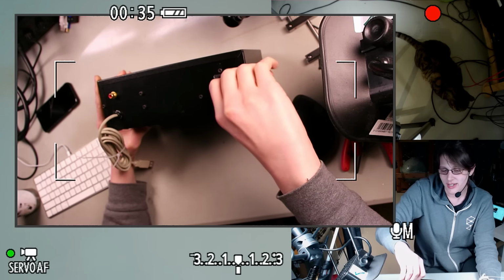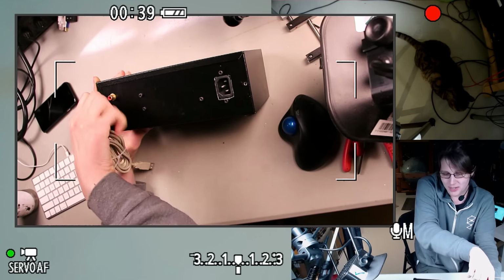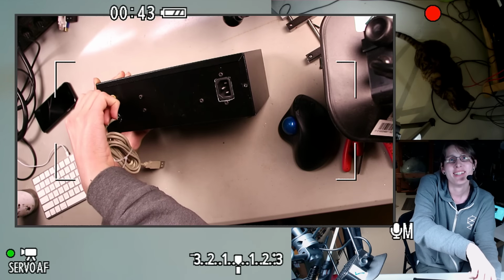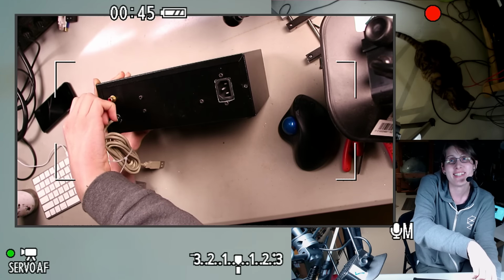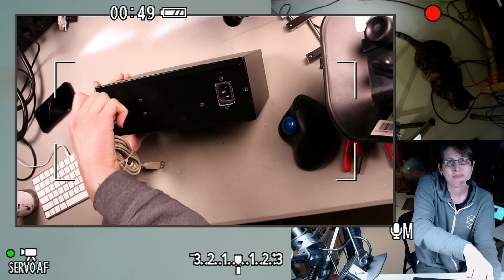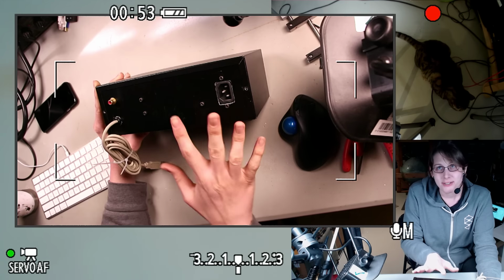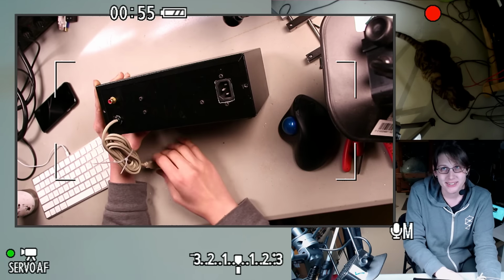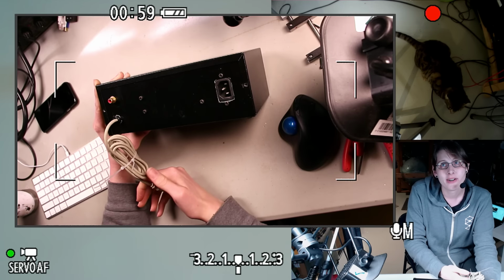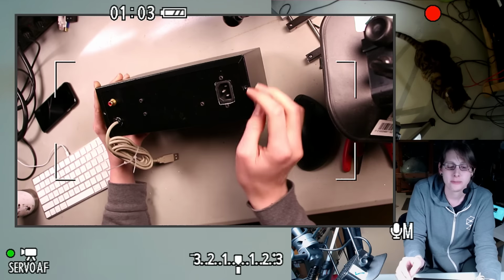Oh yeah, I skipped over something else about the USB spec. So yeah, when I was building this, I was trying to be very USB spec compliant, because I just read this giant document. I wanted to put that to some use. So in addition to being very conservative with the power, so I think this powers the microcontroller, but the IR and the VFD are definitely running off of this. So I think I stayed under 100 milliamps with this.